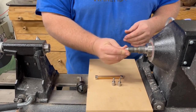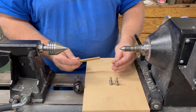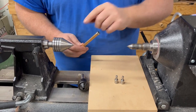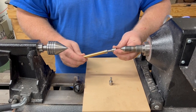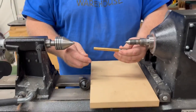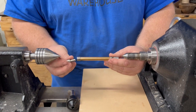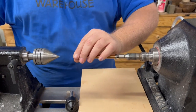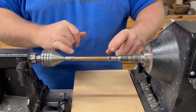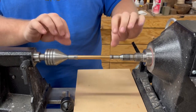If you have a dead center that's 60 degrees — you can see mine is well worn — and a live center that's 60 degrees, you can use what's called TBC bushings. We wouldn't want to just stick the blank right on here because the sharp edge of the bushing would wear into the dead center and live center and cause them to go bad. But I can use these premium TBC adapters — they're premium stainless steel, we make these right here in Arizona. I put my TBC adapters in there and put it right between centers, snug it up, and I'm ready to turn. The TBC adapters are cut at 60 degrees on the ends so they match up right with the live center and dead center perfectly, creating a wobble-free, movement-free way of holding it.